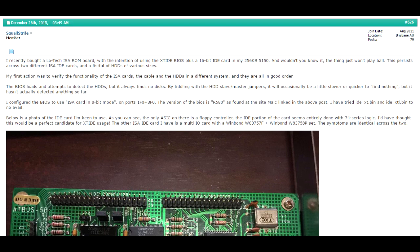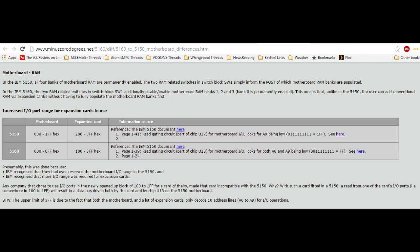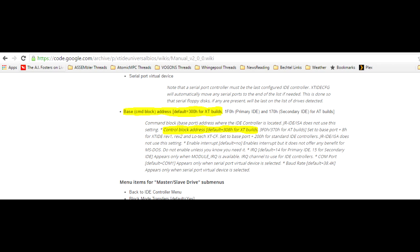To research this, I made a post on the vintage computer forums and found out that a 16-bit card in an 8-bit computer arrangement will not work on the 5150 because of the size of the reserved IO port ranges, which are different on the 5150 compared to the 5160 and basically any clone. This is why on cards like the XTIDE the IO ports are configured as 0x300 and 0x308, whereas on an XT or any other system you would normally use 0x1F0 and 0x3F0.